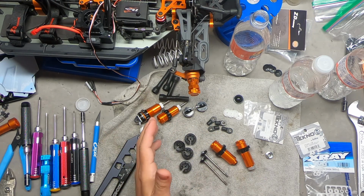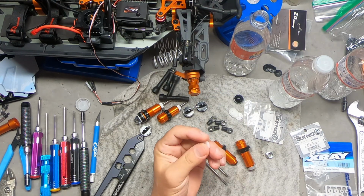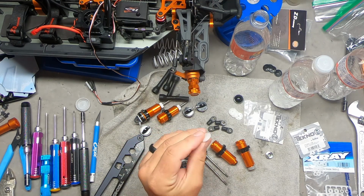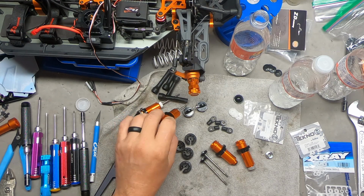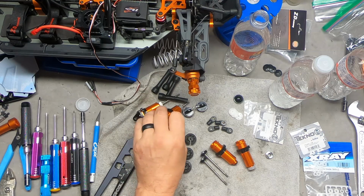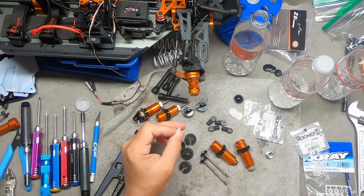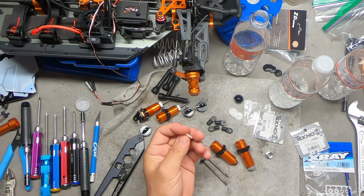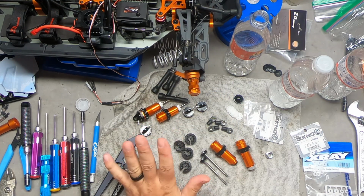So I'm kind of throwing a dart at a board here, but I wanted to go with a flat piston instead of a concave piston because I wanted there to be more of an edge, since these might be a little loose due to less critical tolerances, and so I wanted the piston to have a good surface. In any event, they're machined pistons, they're very accurate, so that's where I'm going with those.